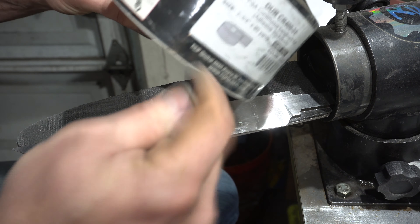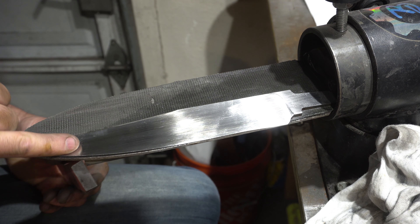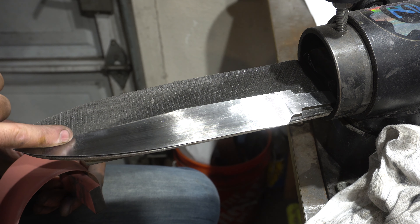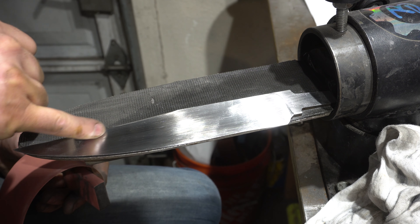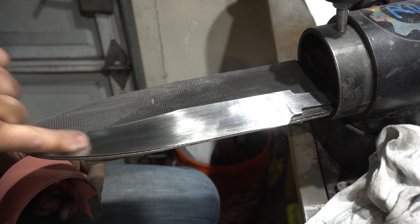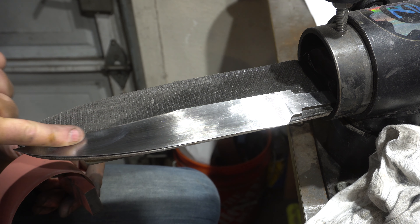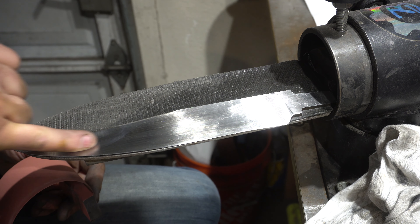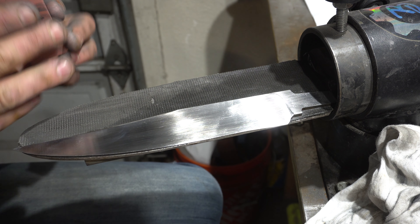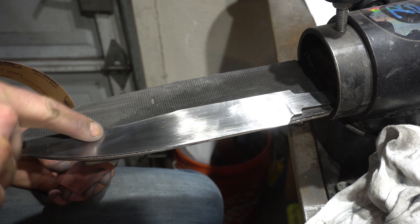Something else I wanted to mention: you can see that I have some grind lines here, so obviously I hit the top just a little bit more than the other areas, which is fine. We'll sand it out, but something to mention — maybe obvious to some but not to everybody — you're not sanding out the lines. What you're trying to do is actually bring down all of the area around it to the same level as the bottom of the scratches. If you just concentrate there without doing all of the surrounding area, you're gonna have a depression. So make sure you sand all this area down to that level.